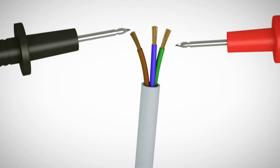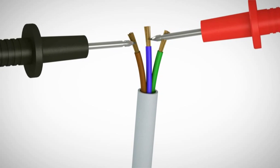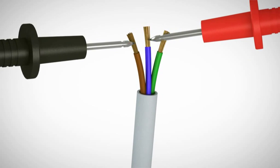Perform another multimeter test to check that the heater has not been damaged, and make a note of your reading in the WarmUp installation manual. If your reading has changed, call WarmUp immediately. Do not continue working. After completing the installation and testing of the heater, you will now be ready to install the floor sensor and connect the thermostat.